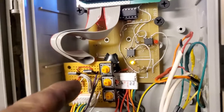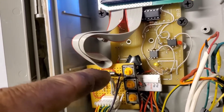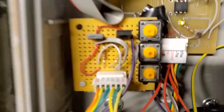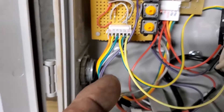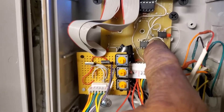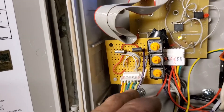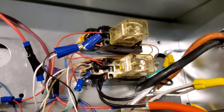That current is not very high, so you take that to these TRIACs, which take AC input on the gate and turn them on. These are what's actually closing at 24 volts. So I have 24 volts in and out — basically the 24 volts goes to the optical isolator, back out, then to the other optical isolator, and back into the TRIAC. The 24 volts goes through the TRIACs and out, which just pulls in the relays. These TRIACs could actually pull in a full typical contactor if needed, so these little cube relays are nothing for them.